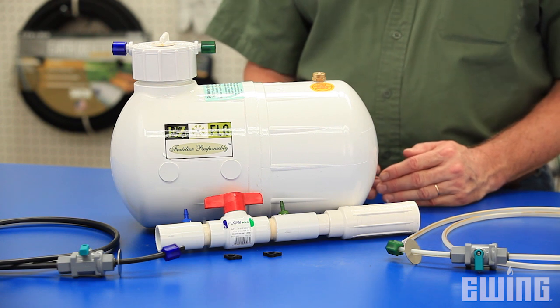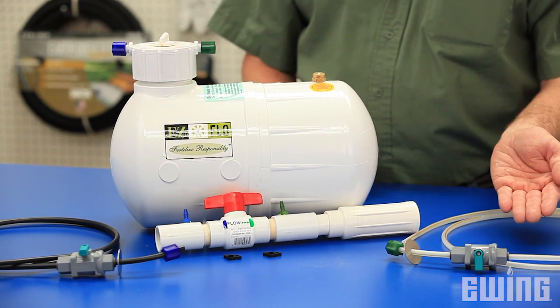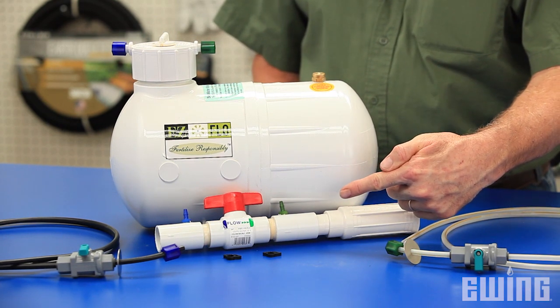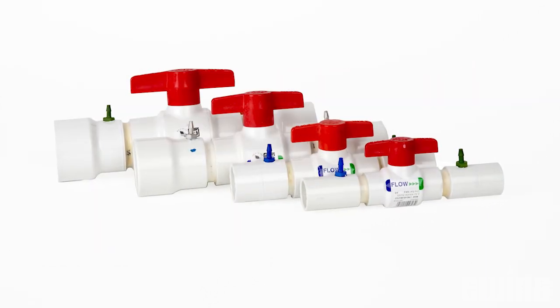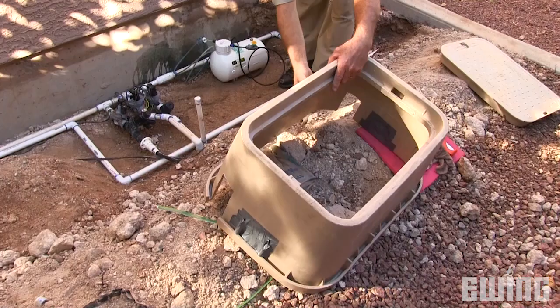The main components of the system include the Easy Flow tank with a cap that allows you to adjust the feed rate, shutoff valves used during refills, and a ball valve coupling that will be spliced into the mainline. The ball valve coupling has two ports: one for filling the tank with water and the other for injecting the dissolved fertilizer into the irrigation system. Be sure to select the correct size ball valve coupling to fit your mainline.